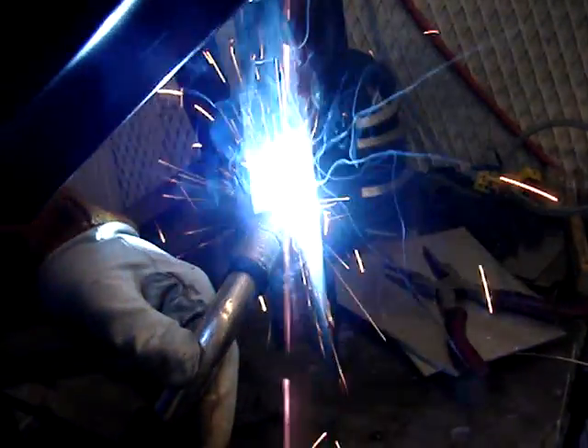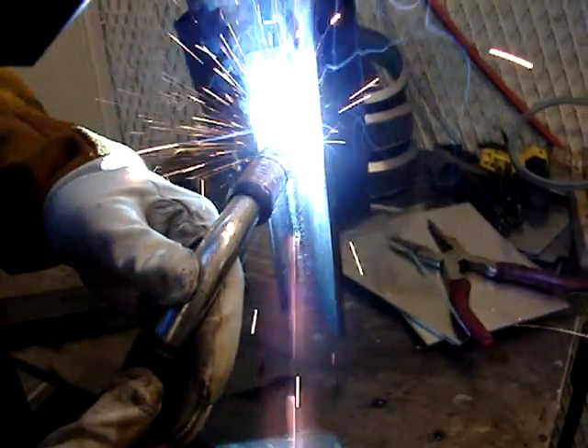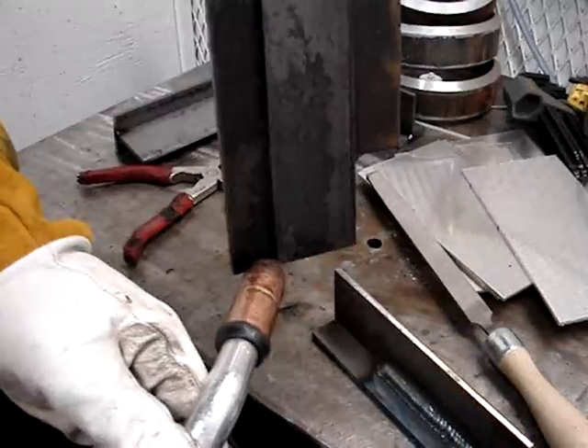This is the triangle technique. We're tracing the front of the puddle and the back of the puddle too — that's the difference. Instead of just tracing the front, you're tracing the entire puddle, but you're still cutting that arc across the leading edge of the puddle — the business end where penetration happens. Both ways have their merits: the upside-down V and the triangle method.